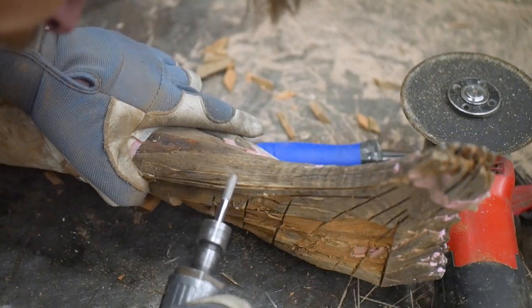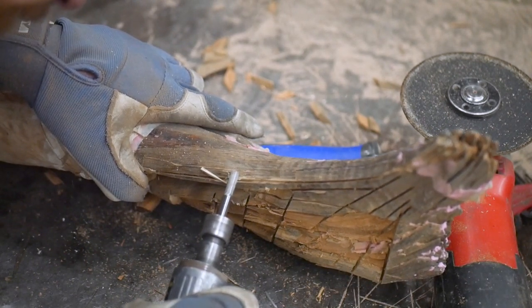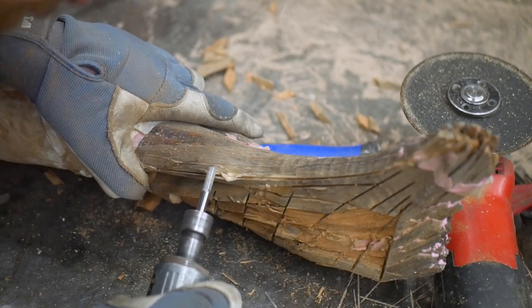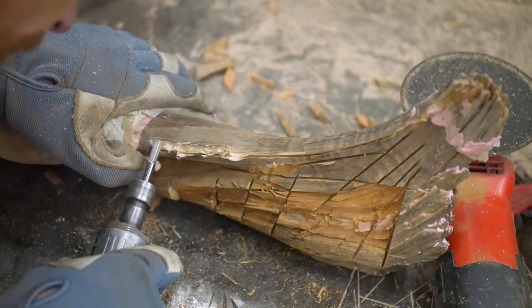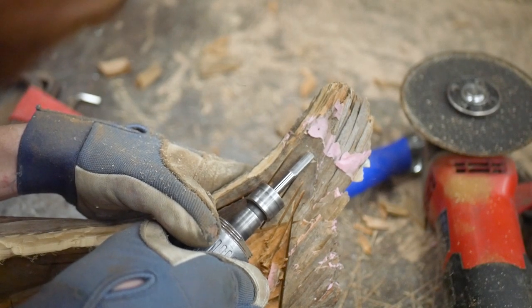For this section, I did actually buy some carbides made for carving wood — this part is a little bit more important. I'm doing a semi-rough cut along the razor line that I scored at the beginning of the video. This exact score line is also in the wax pattern I just made, so it's more critical that these two lines match up later on.